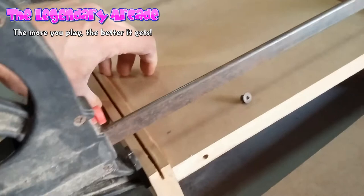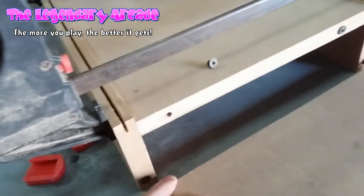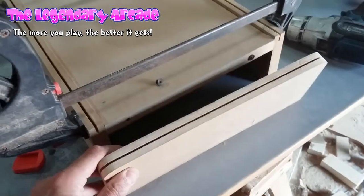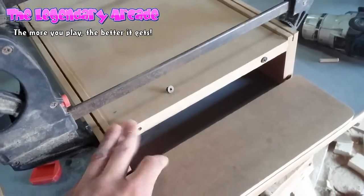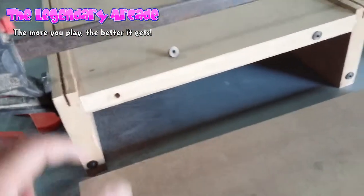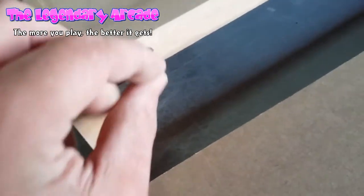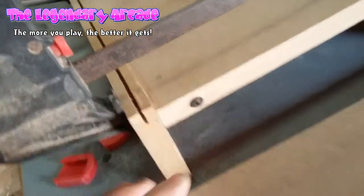Right now I have glued the front and the back on the bottom, and I need to glue the side panels. So I need to glue this one to this. The first part is to drill some holes, six millimeters, in the side of this. When I've drilled the holes, I'll add these small markers into the holes like this.